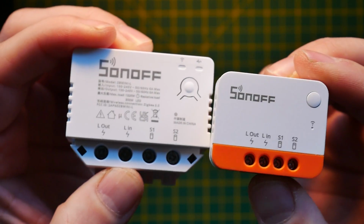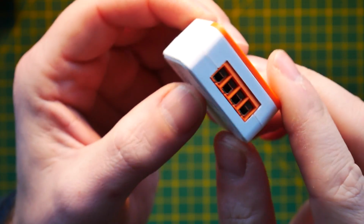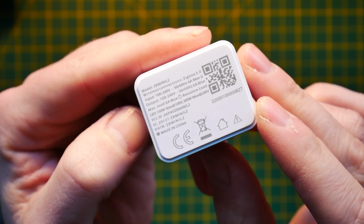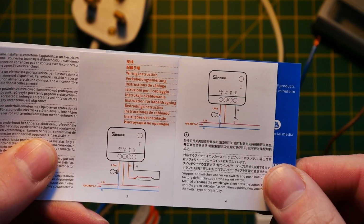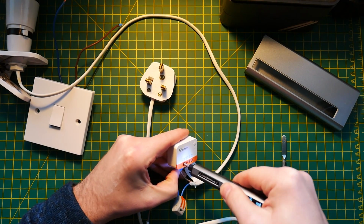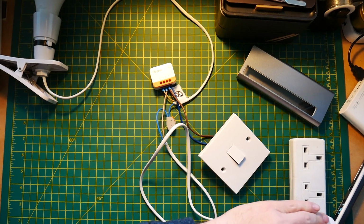I mean, I could compare it to the ZigBee Mini series, but that required a neutral wire, so that's not a really fair comparison. Just like previous edition, it's a single channel relay that uses ZigBee to connect to your home automation, so you're gonna need a hub of some sort. And it will allow you to connect a switch in one or two-way configuration to it, so that way you can still utilize the hardware switches and take advantage of the smarts and toggle your lights. It uses ZigBee 3.0 and it's rated for 6 amps. Plenty when it comes to directing your energy towards your light bulbs.